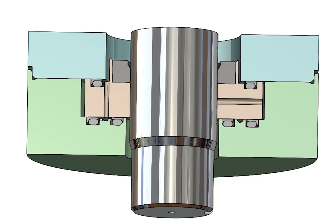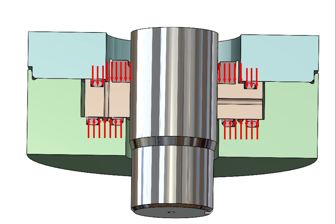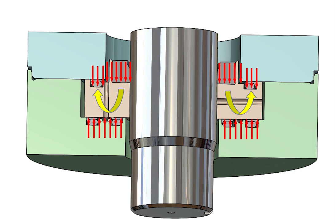There is a slight radial offset between the upward acting hydraulic force and the downward acting hydraulic force. This radial offset applies torsion to the backup ring. If not addressed, this torsion will cause cross-sectional twisting of the backup ring that affects its fit with the shaft.